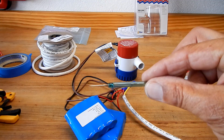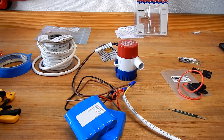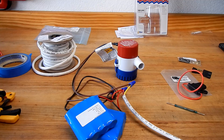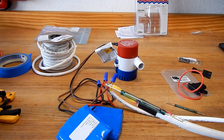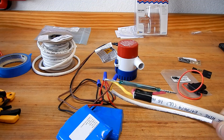When you cross a magnet over the reed switch, it trips the circuit and starts the pump. Some bilge pump setups I've seen use a smaller, lighter-weight switch — like a door security contact rated lower — and then use a relay to handle the main current for the pump. But I'm going to try doing it without a relay first. When you're done, you end up with the switch soldered into the line.